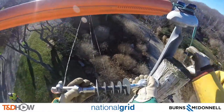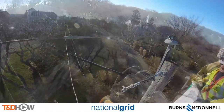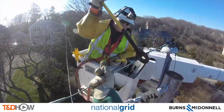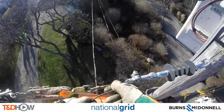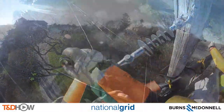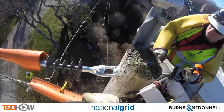Here you can clearly see the dead end being applied to this side of the pole. They're also attaching a set of blocks again — as we saw on the other pole — to hold the line in place as they cut it from the conductor. There's an even better view here of that freshly cut line being threaded and then clamped into the dead end on the pole. Now the blocks can be removed and the old conductor taken off the top of this pole as well.